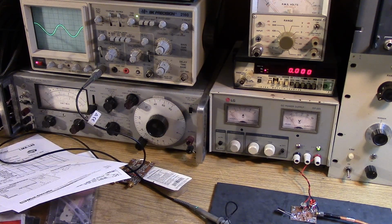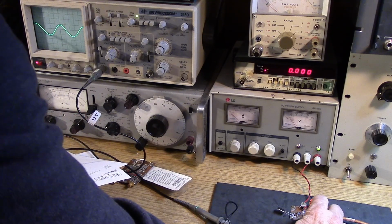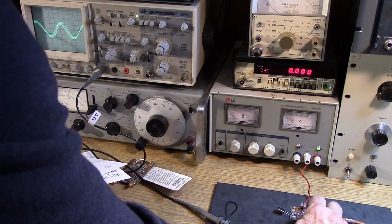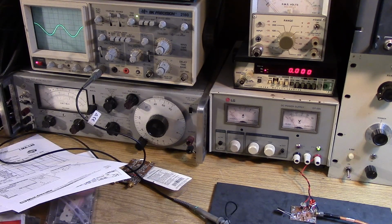And if I attempt to lower the source resistor a little bit, it seems to get even squirrelier. Wants to do some VHF oscillation. So the message on the FET is it'll work fine if you give it enough voltage. I think the bipolar is a little easier to control, and it probably puts out a little more power than the FET.